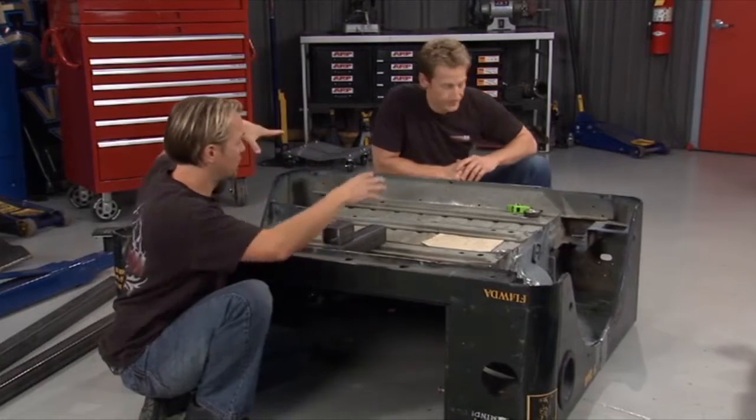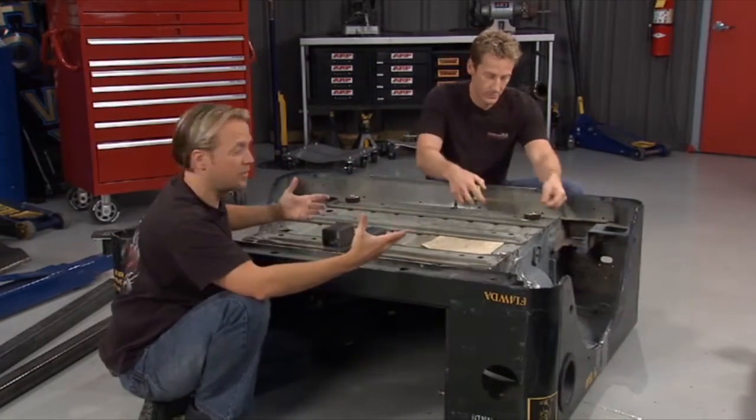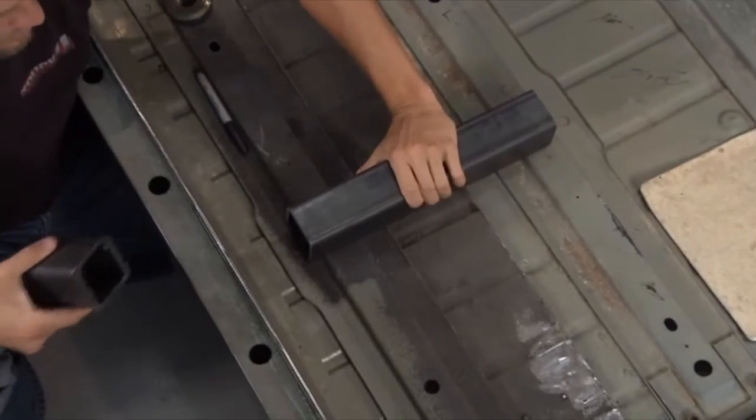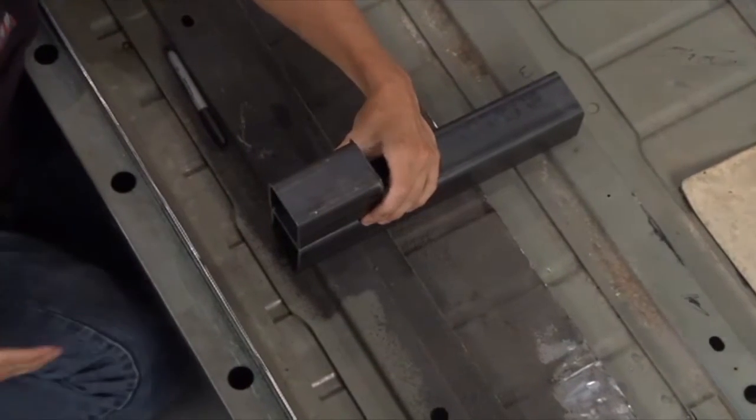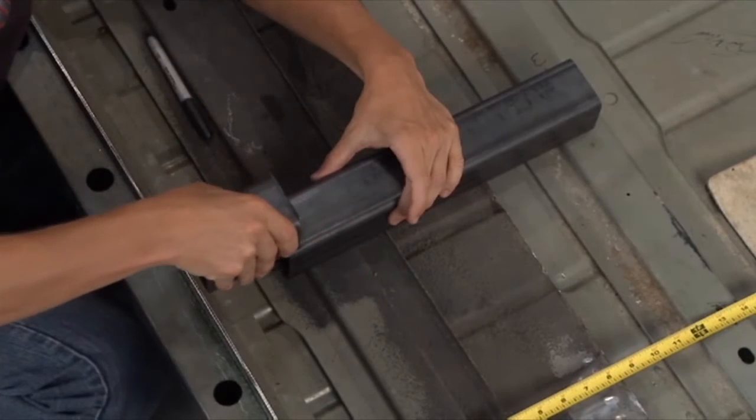Yeah, absolutely. Now, once the frame is going to get attached to the back here, you're going to have a little issue if you don't use a spacer, because take a look at this. Now, this would be the frame, right? This little piece. But we're actually going to have this tongue that's going to go from the front to the back all the way through. That's going to be one solid piece. So we're going to have an issue right there.